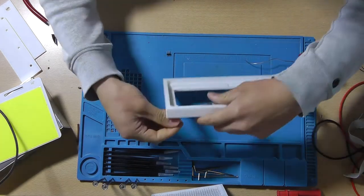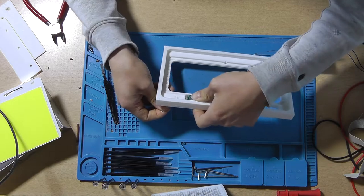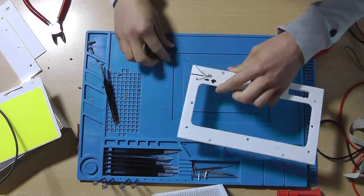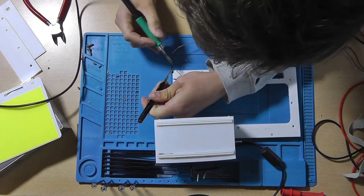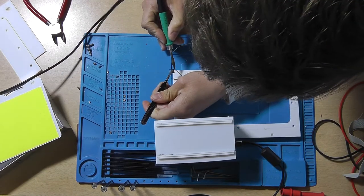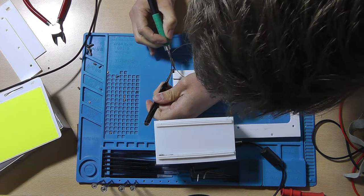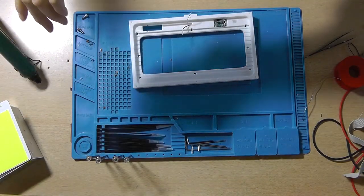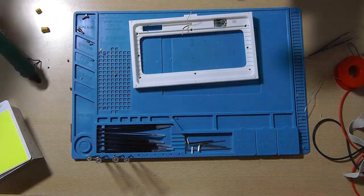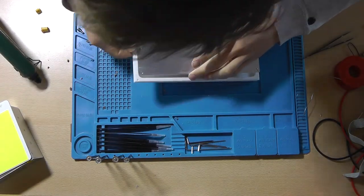And once that's done, you need to install the buck boost in the slot that I created for it in the 3D model. And you'll need to solder a 2.5mm header to the output wires, and the fan connector will just slide on top of that header. Finally, we'll be gluing the 2.5mm connector at the back of the case, so that it will be nice and sturdy when you connect the fan.